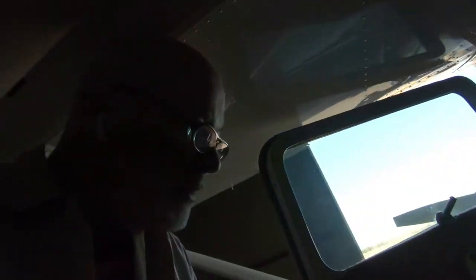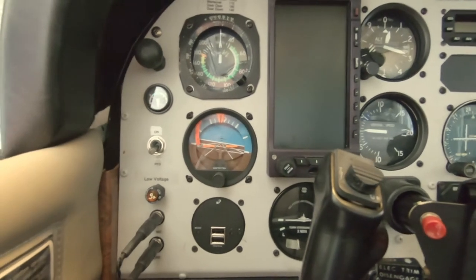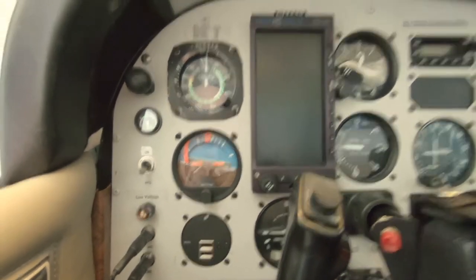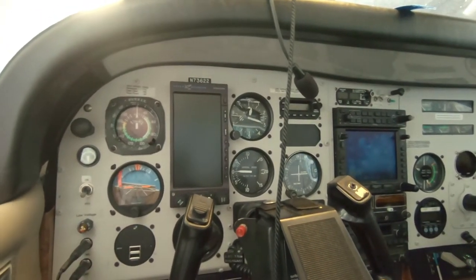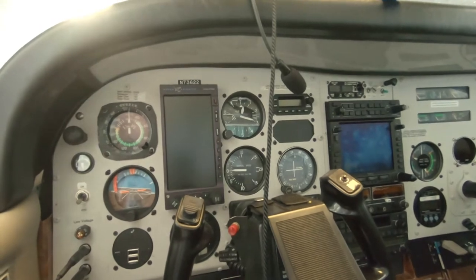This whole effort is based on what happened to me a few weeks ago. I was flying back from Oregon and I noticed my secondary vacuum gauge failed, and the secondary attitude indicator was giving me the gyro problem. This is the only vacuum instrument in the entire plane. I've got an Aspen backed up by all the standard six-pack instruments still, and I started looking at what I could do to replace this mess with an all-electric solution.